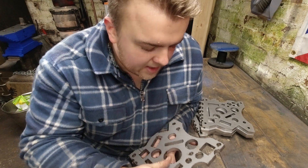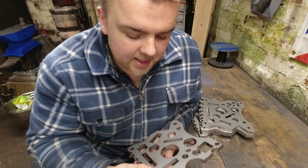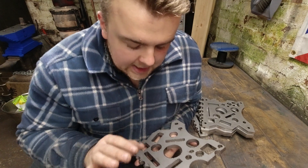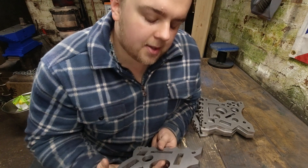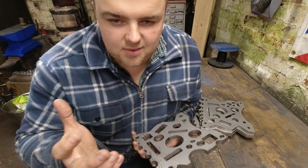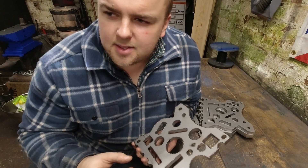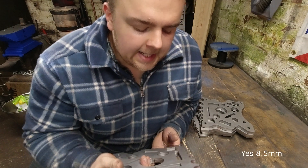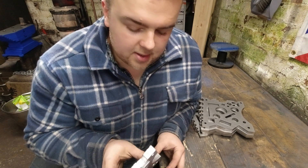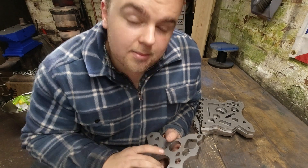So we've got to deburr all these plates, get them nice and flat. Similar to the other one, we have a washer plate and then we have the nut plate, as I'm going to call them. Unfortunately when I got this laser cut, the quantities were the wrong way around. The one meant to be the washer plate I did at 11mm, and the other was a tapping size of M10 — I think that's 8.5, off the top of my head. So we need to drill out all of these four holes and then tap one of the plates and put it together. That's kind of it really — nice, quick, easy, simple video.